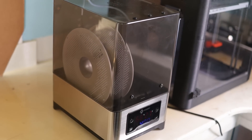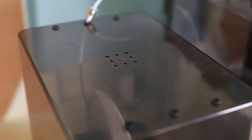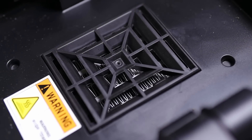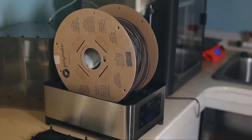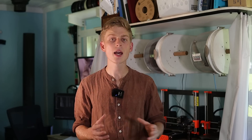There are a number of filament dryer options on the market now. FixedDry is one of them and they follow a similar design to a lot of other recent filament dryers — basically a container that holds your filament, with vent holes on top, a small heater element in the bottom with a fan that takes air, heats it up, and blows it into the filament chamber. In the case of the FixedDry it does mechanically have a pretty nice setup — it holds up to a 3-kilogram roll inside, or two 2-kilogram rolls, which I kind of like because dryers that limit you to one kilogram are pretty limiting since I use the big rolls a lot.